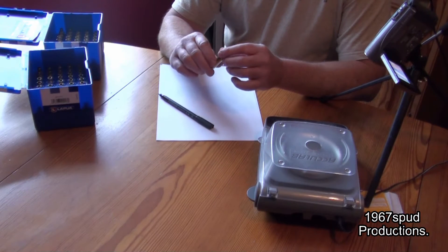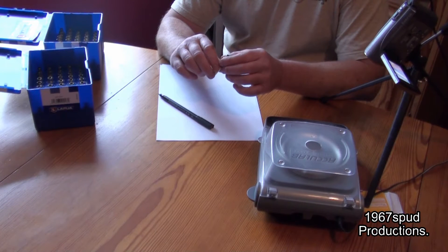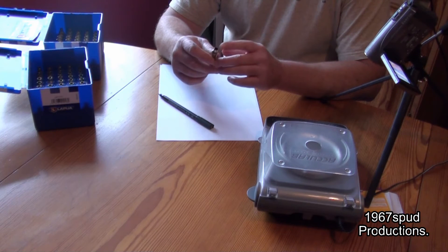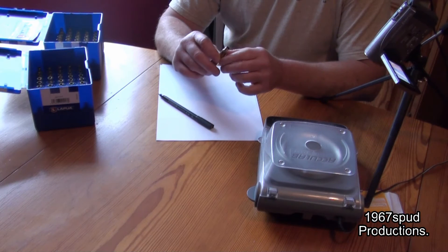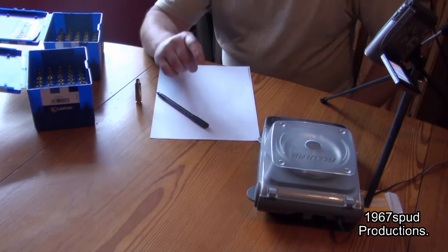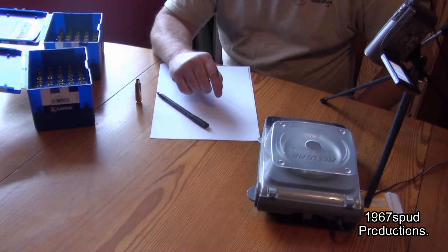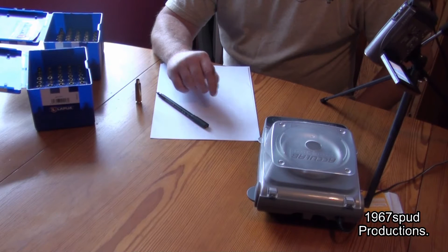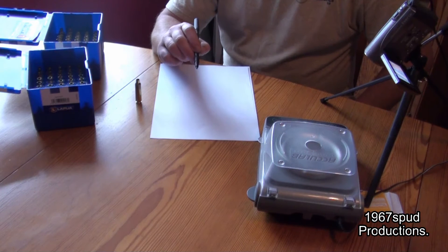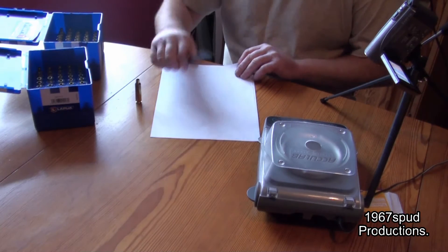There will be a bit of variance between the highest and the lowest. I haven't measured any yet, so we'll find out as we go along. I've got the first 100 to do. I thought I'd do the first 10-15 for the camera. I've got two cameras running here at the moment. I've got my scale zeroed, reading down to two one-hundredths of a grain — they should be fairly accurate. I'm going to batch my cases in groups of half-grain intervals. I don't know what they'll weigh; I've got a piece of paper here and I'll make various little groups as needed.